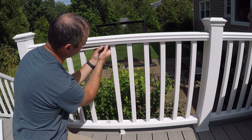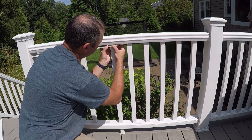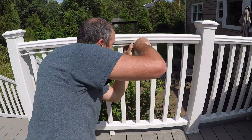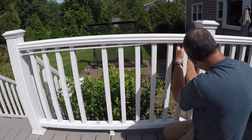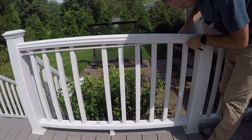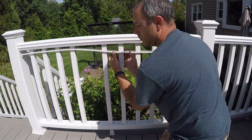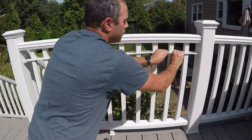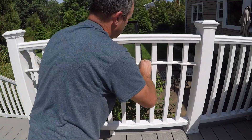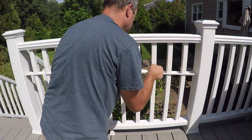If I run into a tough spot, I'll stick the putty knife back in there and pry again. I'll stick the putty knife on the backside and just keep working that down little by little, working it side to side. I want to work down this spacer until I can get my tool in there to get to the screws underneath the top rail. This is going to be really snug to the baluster, so really got to work a little bit at a time. If it's cold out, you've got to be really careful you don't break it, but in a warm climate they should work down with a little side-to-side motion. Once I can get my drill in to get the screws out from underneath, I stop and start taking the screws out. I'll just test my drill and make sure it fits on both sides — if I can get in there and get the screws out, I'm good.